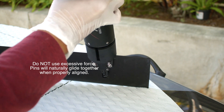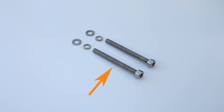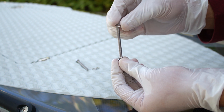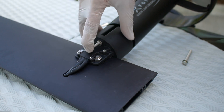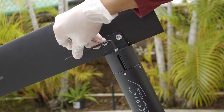This will cause damage to the female side. Once the motor is fully inserted, use two M5 by 55mm screws, two M5 lock washers, and two M5 flat washers. Insert the lock washer in first, followed by the flat washer. For extra protection, we recommend using removable thread lock, such as Loctite Blue 242. Tighten firmly with the provided 4mm hex tool.